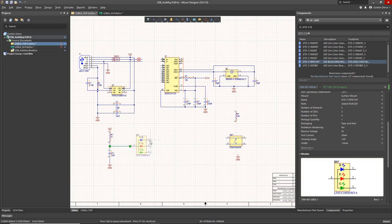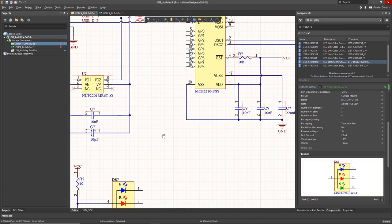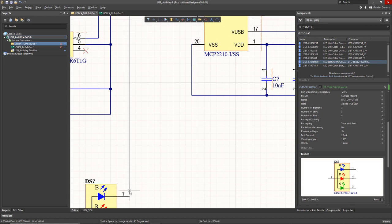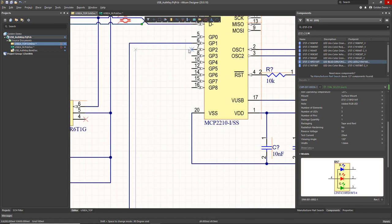That's going to come out to the anode of my common anode RGB LED chip, the LTST-C19. There it is in the library, so I'll place that one. I'll drag it over a little to make some room for wiring it up to the GPIOs of the bridge. You can drag wires around and using simple shortcuts you can do cool things like bring a whole bus of wires around a corner. You can change wiring modes by cycling through using Shift+Space. GP1 through GP3 are going to be used for my blue, red, and green LED chips respectively.